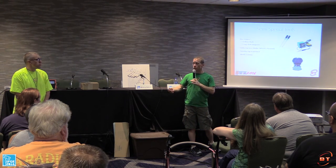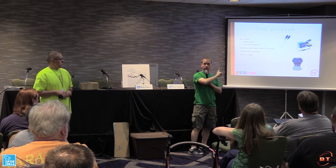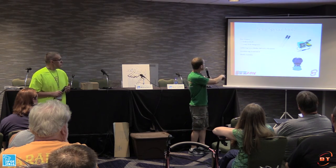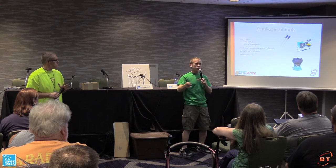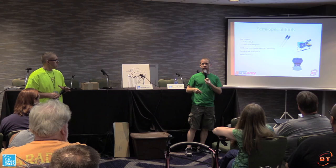If you're looking to do some basic pinball repairs, I suggest you go out and don't get a non-temperature controlled couple dollar soldering iron. If you're working on a pinball machine, get a couple of good tools. You don't have to get super expensive stuff, but you would not believe how something as simple as that saves a lot of time and a lot of frustration. And then along with that, some desolder braid and wicks so that you can pull the solder off the coils. We can talk a little bit about that later if anybody has any specific questions on how to use that stuff.